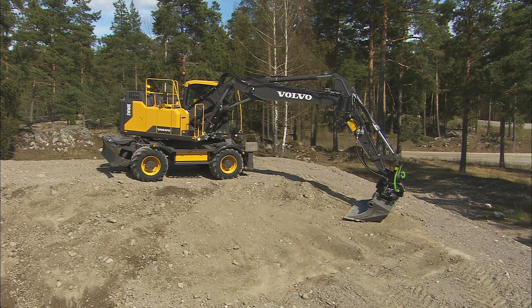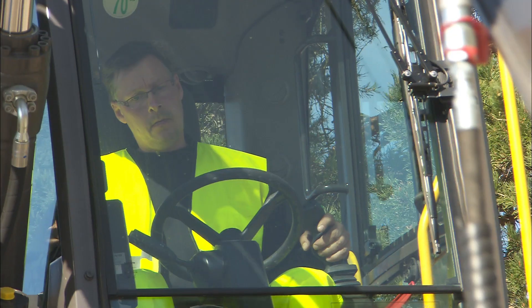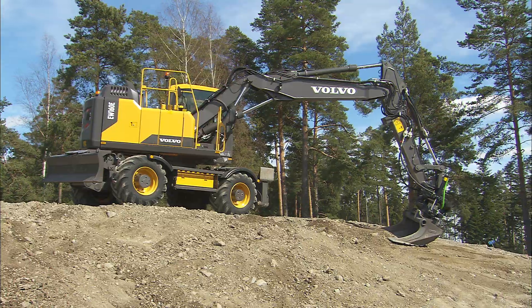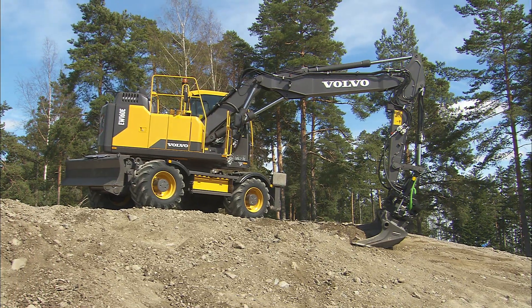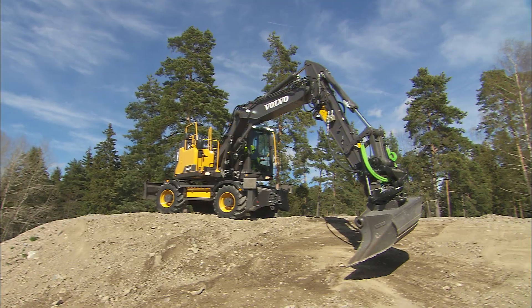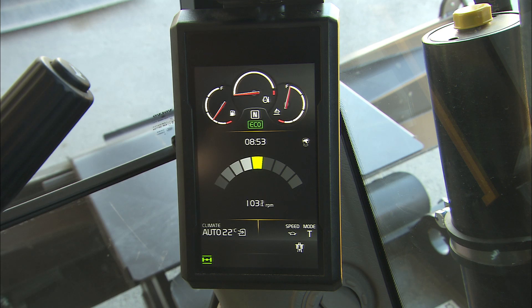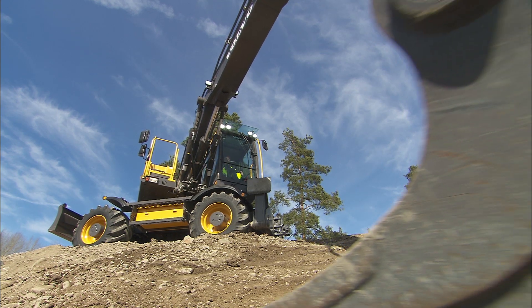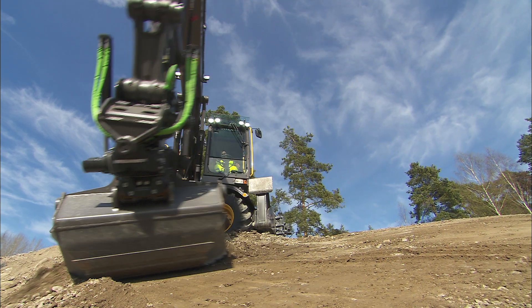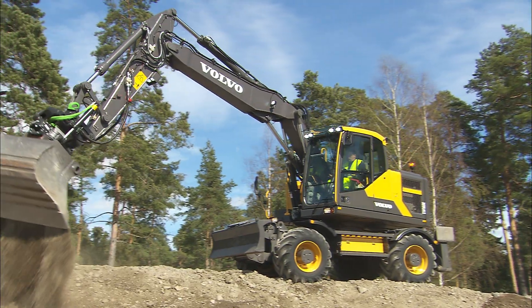Grading is often used for ditching or surface preparation, done with an excavator by flattening out the surface with the bucket. This will happen if the boom, arm and bucket get homogenous movement with teeth absolutely parallel on the ground. In many cases, the outcome can be improved by reducing the engine RPM since there is a relatively small load on the engine. A mid-range speed will be enough, which will prove to be much more efficient than working at full revolutions and reducing the speed using the joysticks.